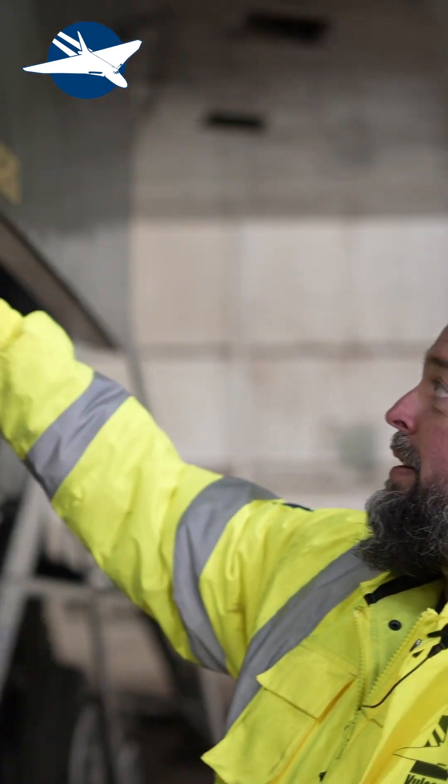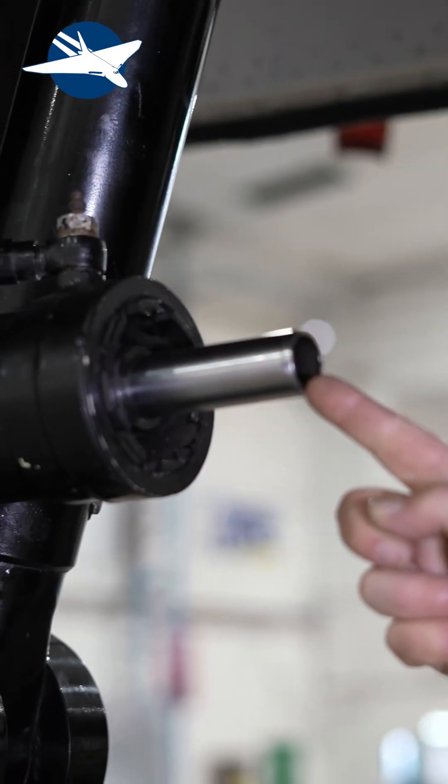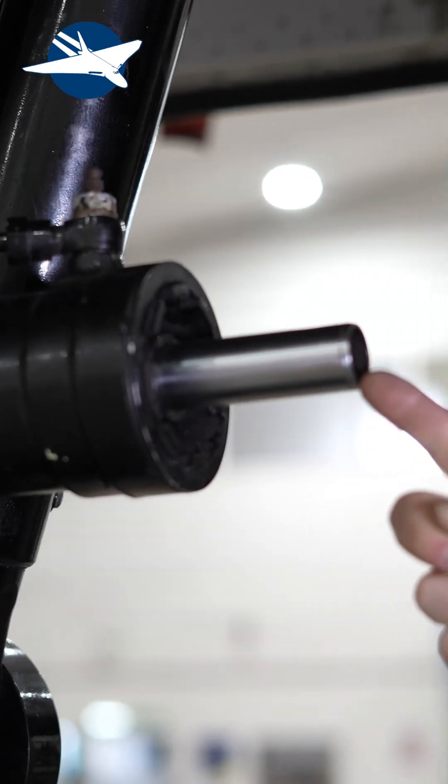The alternator intake skin is up there — it's come off as it had a bit of corrosion, so we're going to swap the skin. It's much easier to just change it completely. On the nose undercarriage, the steering motor — that black bit on the back there — has been swapped. There was play in the old unit, so that's been swapped out; we're just waiting for new seals on that.